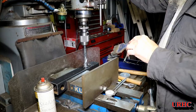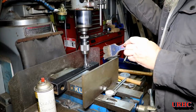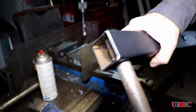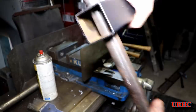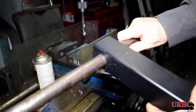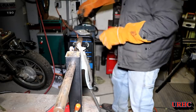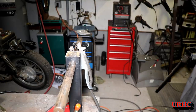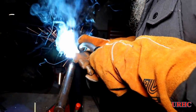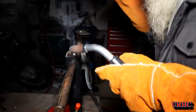I got the hole drilled and found the old piece of one-inch steel — it wasn't quite as long as I wanted, but it was all I had laying around. It fits in there really nice and tight. I figured someday I'll put a longer one in, but for now I'm just going to tack it in place. I grabbed the welder and cranked the power up for that one-inch solid bar, but I forgot to crank the wire speed up too, so it was hitting and missing — but just for a tack, it worked anyway.